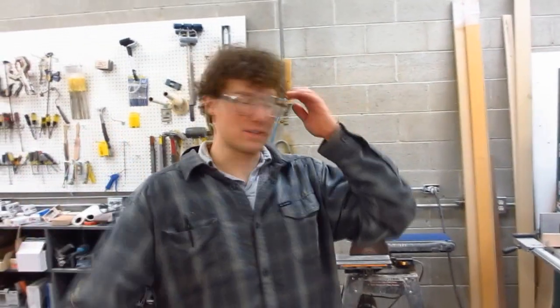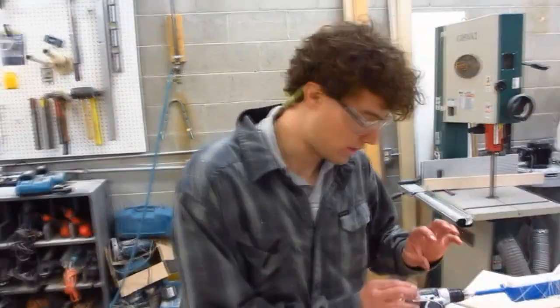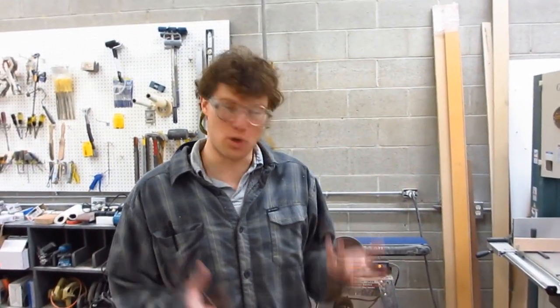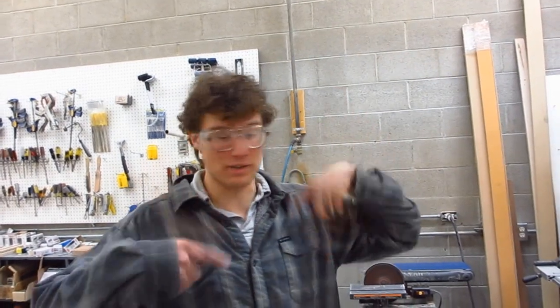The really exciting thing is that this could potentially be an entirely mechanized process. You design your mold in computer space, have it cut on a CNC machine, load it up into the mandrel, push the button, and you've already programmed where you want each tow of carbon fiber to be placed on that skateboard deck. You can tune the board entirely with computer-aided drafting and create the ultimate skateboard that will be literally printed layer by layer. Then it's just a matter of severing the two halves, bringing them together, and filling it with some kind of core material. You could hypothetically mass-produce boards without laying up wood, without using glue — just push the button, wind the thing, bake it, cut it up, and turn it into a skateboard deck.